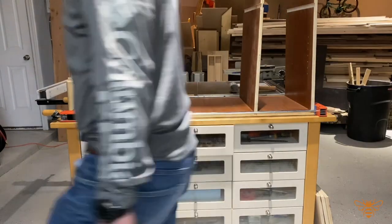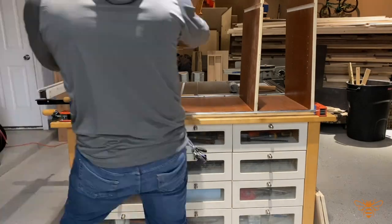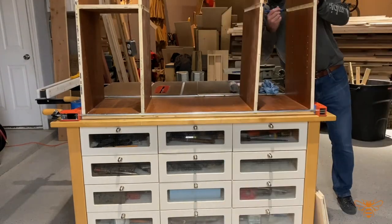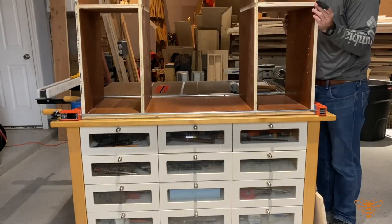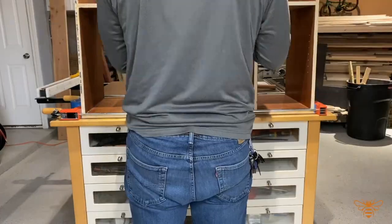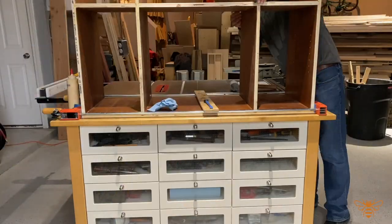The back of the cabinet is towards the camera, so I'm constantly checking the front piece to make sure those are flush to the top, because that is the most important part. That's where the trim work is going to go, and if it's a little bit off it's going to show. When inserting the base pieces into the dados, put glue on both the dado joint and the edge of the base piece. When you slide them in you'll get glue squeezed out — that's fine — but keep a damp rag around to wipe off and clean those joints and keep the interior looking nice.